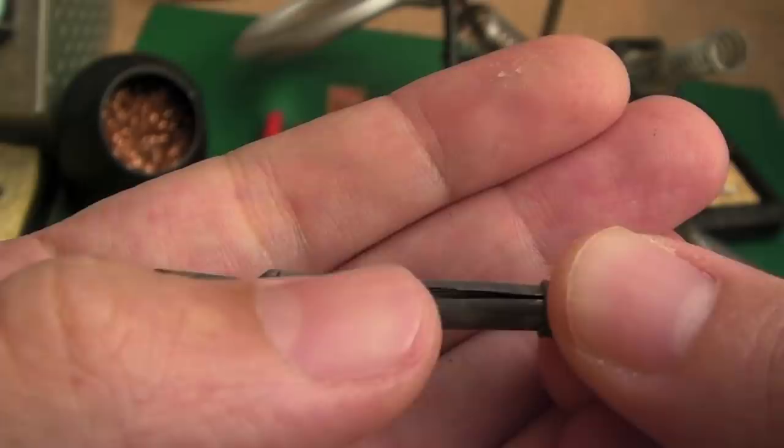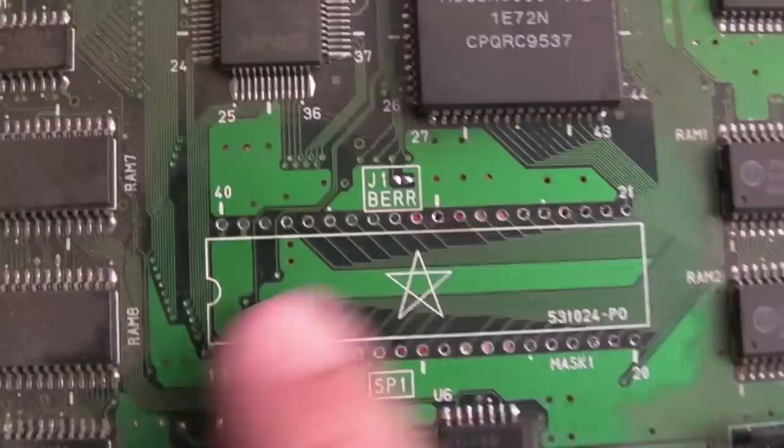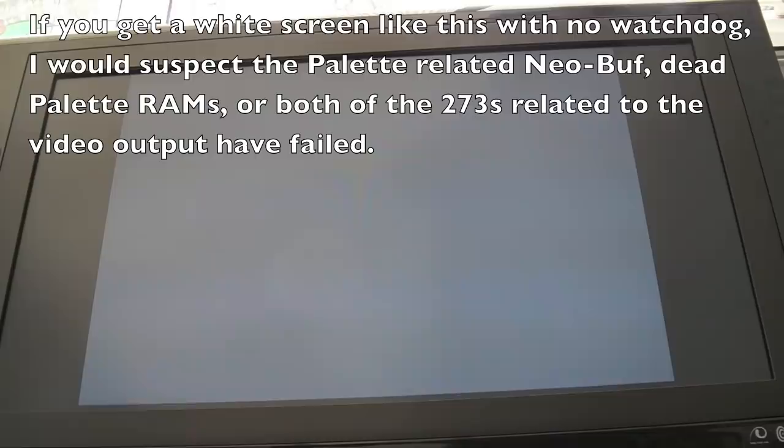I mean, look how pointed upwards that is there. Yeah, brand new. Sweet. So the BIOS removed from both boards, get sockets onto both of those now. So this one just gives a grey screen. I'm going to probe the watchdog circuit, I think. Well, I'll probe the reset pin, that's the easiest thing. If we're getting pulsing on the reset pin, that would indicate it's in the watchdog.